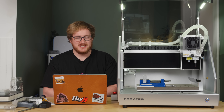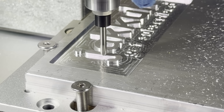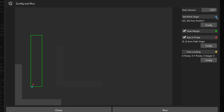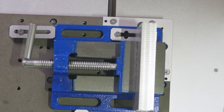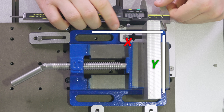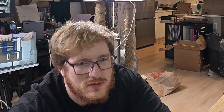I spent the last two days trying to decide what to machine in a reasonable amount of time with the metal pieces I have, and I came up with engraving my YouTube channel name on the top of the piece of metal. With the help of Fusion 360, I was able to set up tool paths for cleaning the long side, the short sides on both sides, the bottom, and then cleaning and engraving the top. All of those are separate files we have to load. We select our file and then tell it where the actual piece is. From the anchor corner position, I can eyeball it or use the manual probe — but I'm just going to measure it and say our Y offset is zero and our X offset, super duper eyeballed, is like 22 and a half-ish.